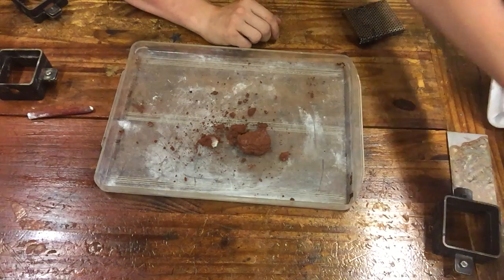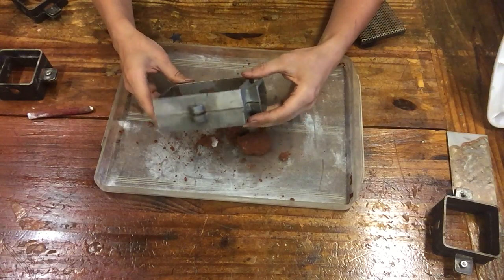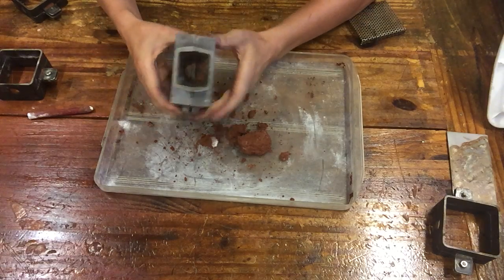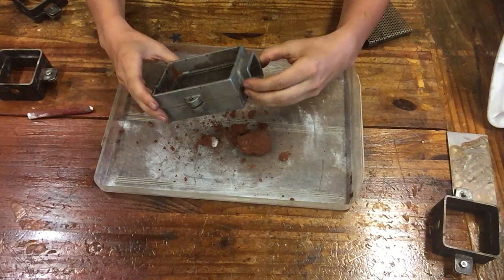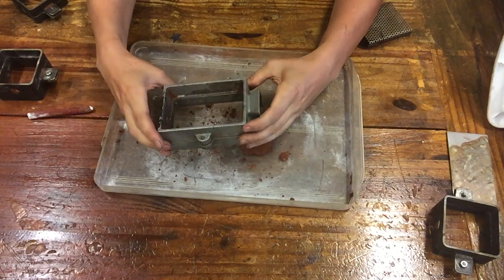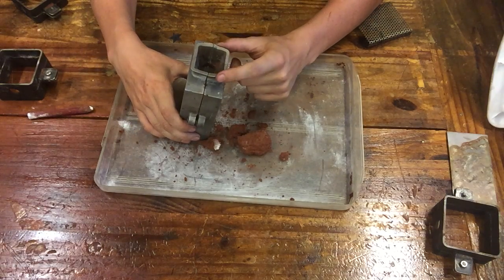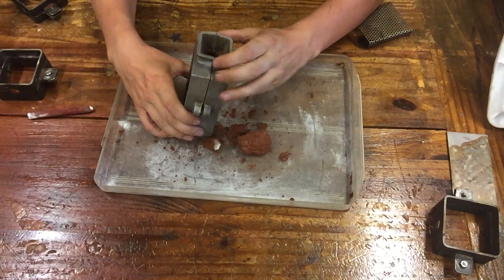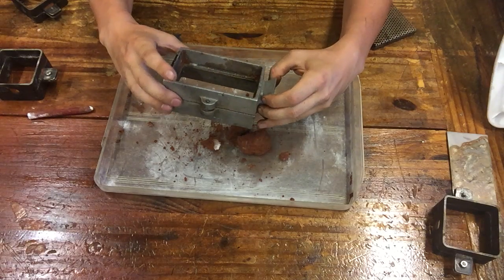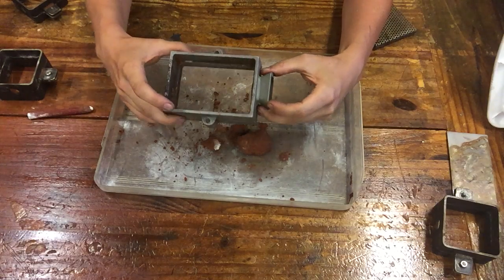When you're looking at designs, you'll see this horrible contraption available from many of the suppliers. I don't like this design mainly because it's huge for jewelry, but also because this frame is cast out of aluminum, which is a low melting temperature metal. So if you have enough bronze, you can actually alloy with the funnel if you have a high enough heat and a long enough charge time. You do want to be careful about using metals that have lower melting points than what you're going to cast with.